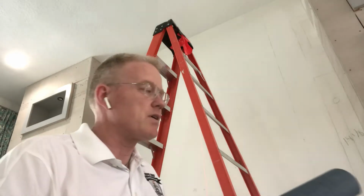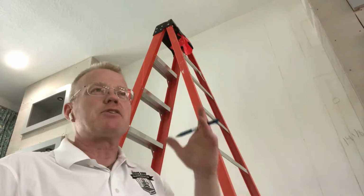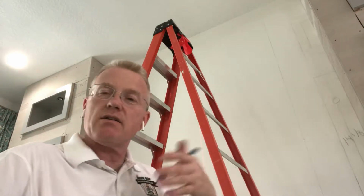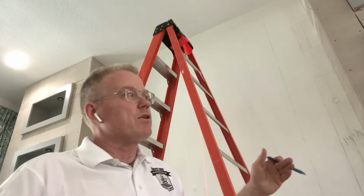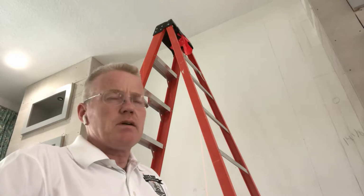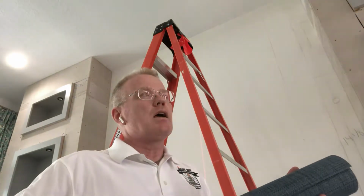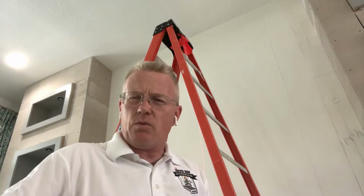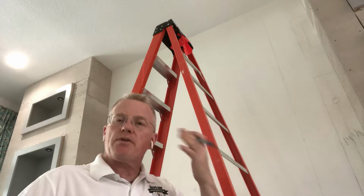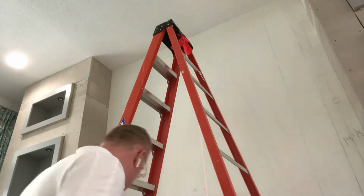That's not the case. Because when you do see the seams, your eyes are demanding symmetry, whether you know it or not. Look at somebody's face. If they were missing an ear, you would see a lack of symmetry. If you look at a feature wall and you see the seam, especially on grass cloth, you're going to see the seams. If you see the seam 4 inches from the wall, say, what's that? It will only agree with your eyes if it's symmetrical. Okay, so you understand that. I'm going up there to do my markup.